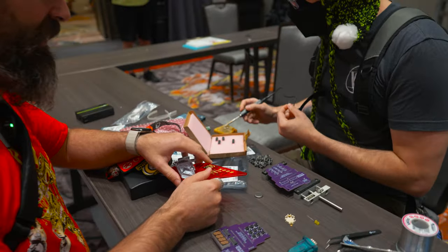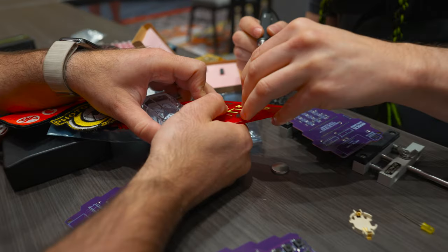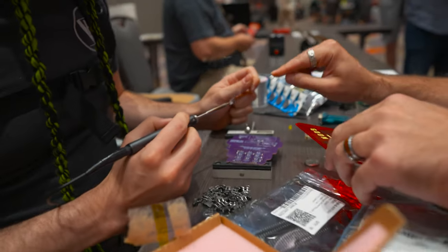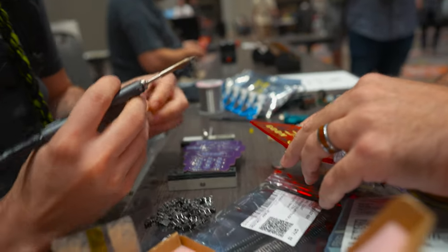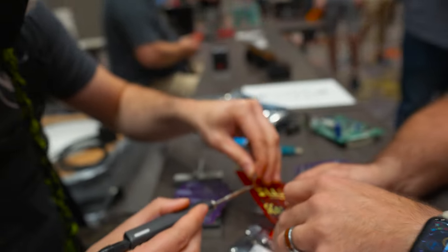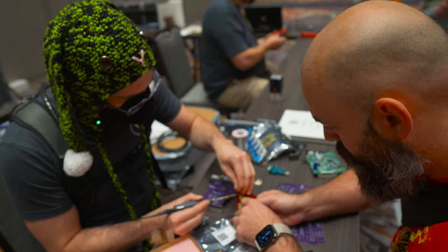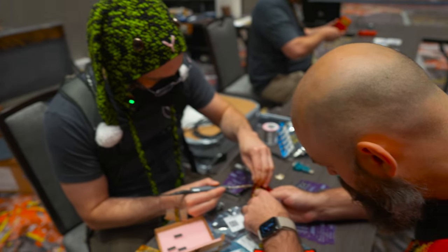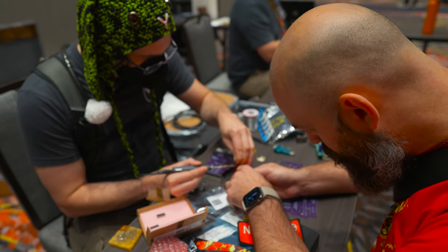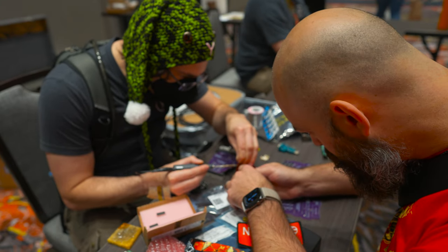Let's see if I can do it without destroying my iron in the process. I hope you realize how much I like you. Let me get some solder on here to get some heat transfer. So you're saying if you just heat up the LED it won't push through? The solder helps transfer heat from the iron to the leads of the LED. It's slowly going through.